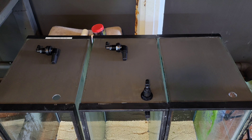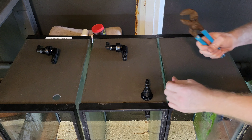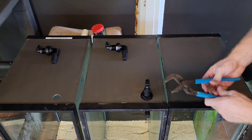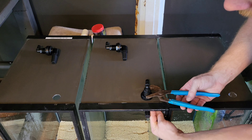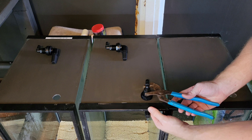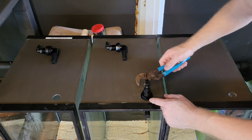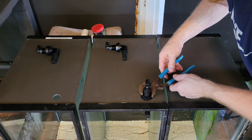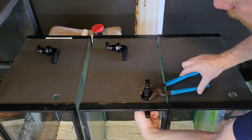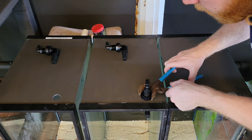Alright, then grab my pliers. This part you've got to just take your time — this is glass, so you don't want to tighten it down until you can't turn it anymore. You want to get that rubber gasket on the inside pressed against the glass real tight, and you'll start seeing it bulge out just a little bit. I've done so many now that I can feel just about how tight it needs to be. It needs to be tighter than hand tight, but not super tight. Maybe just a turn or a bit more.